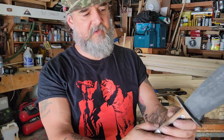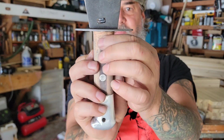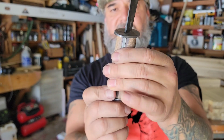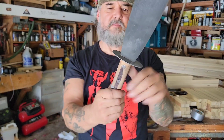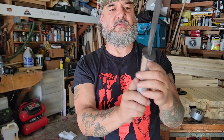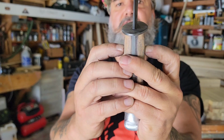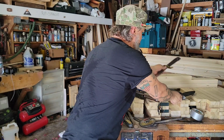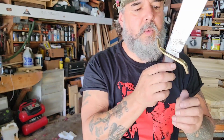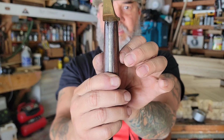So a little bit more sanding, and I would like to taper this right here more, but that pin is right there, and these scales did get loose. I re-peened both pins, but I could see popping these off, making new scales that taper from about 7/8 of an inch to the blade in on an angle, similar to what you see here with the W49. You guys remember that right here.